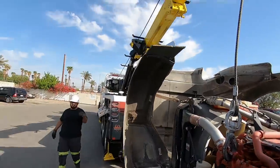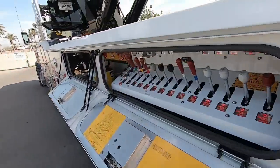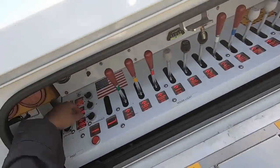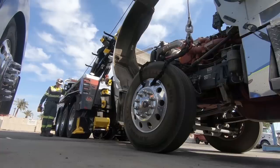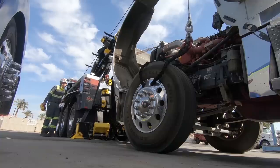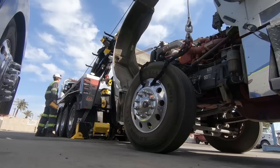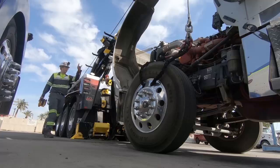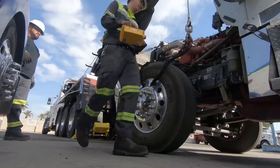Alex has locked in the winches. Now, while we're not lifting very heavy weight, we should always set down the rear outriggers — just set them down, we don't have to extend them. And even though we're not rotating, we should always unlock the boom. That way, if for whatever reason we overload one side slightly more than the other, we're not putting the pressure on the pin — we're putting the pressure on the ring gear.